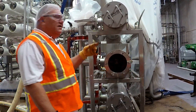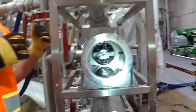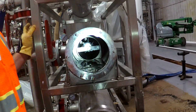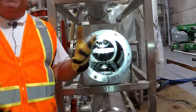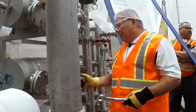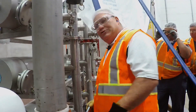Now we're going to go back to the other side and open up what they call the maintenance port, which is clearly shown in the manual. You're going to come up to this end first and push this all the way back, because there's a lower bearing holding in the hydraulic motor. We have to take the hydraulic motor out in order to pull the whole assembly out. We're opening the maintenance port so we can get to the hydraulic motor, pull that out, and pull the dirt collector out with the screen.